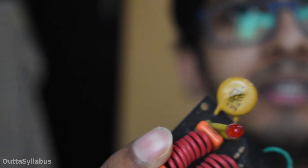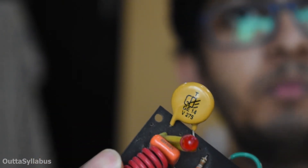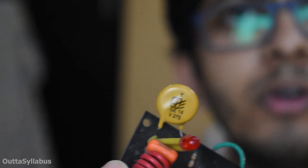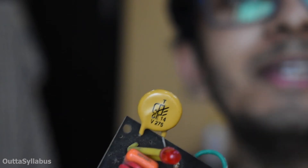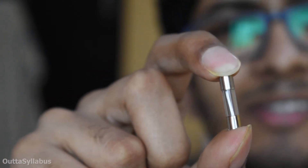But there you can see the blown-away circuit — it has V275, meaning a threshold voltage of 275 volts. Anything above 275 volts will act as a short circuit. So for now I'll just cut this, salvage it, and solder it between the phase and neutral. That'll provide protection against surges. As soon as it becomes a short circuit the fuse will blow away. I also have to replace the slow fuse with a fast fuse, so that the MOV doesn't burn away before the fuse. I'm still thinking about how much of a moron I was — who installs a slow fuse in a power strip where safety is the first priority?